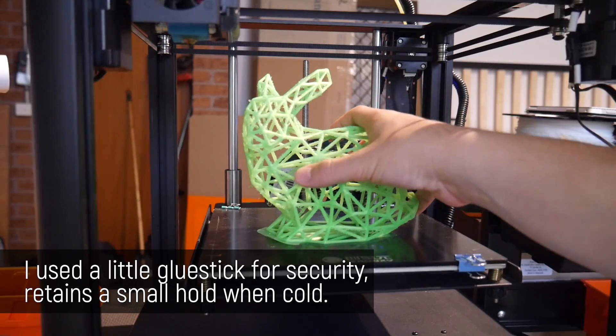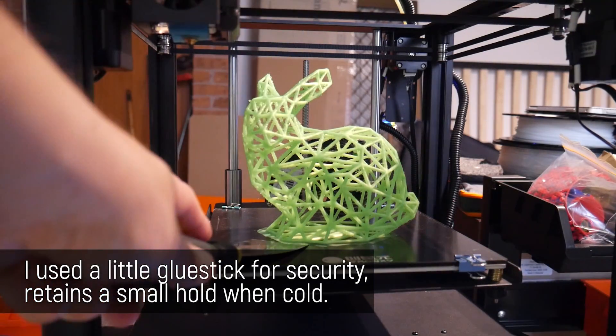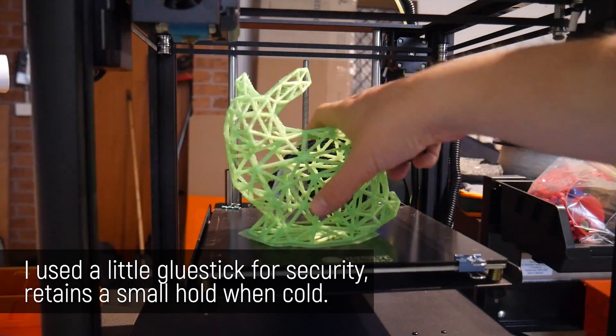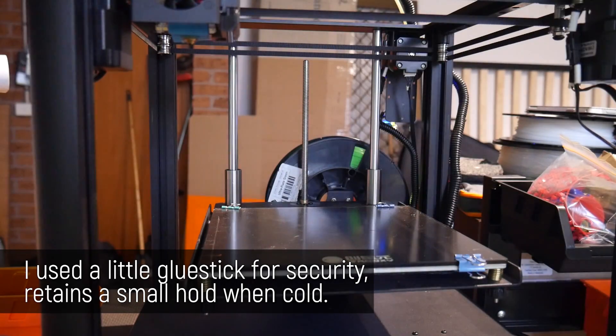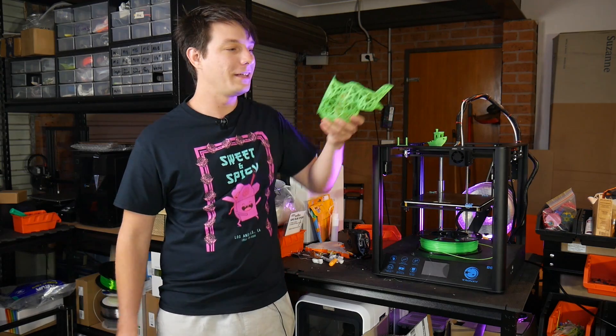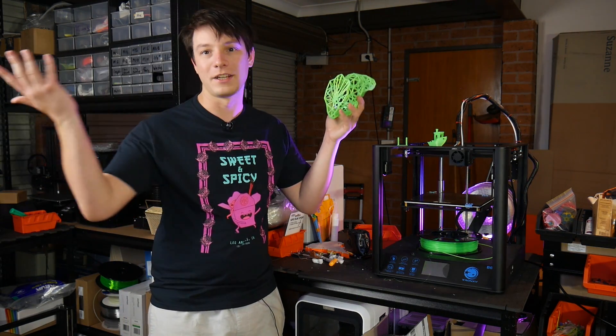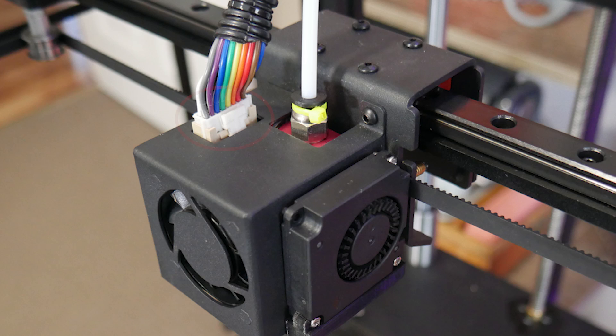For X and Y that's okay — unless you're recovering from a power loss the repeatability isn't so important. But the Z-axis limit switch at the back — I don't know why they went with it; it sort of pushes on the edge of the linear bearing, which is very iffy. But it does seem to hold a decent enough first layer. A decent first layer is critical on this ultra-base style bed, which does heat up quite fast. It's 220mm so quite small compared to some other machines at this price point, but when the prints cool down they just pop free.